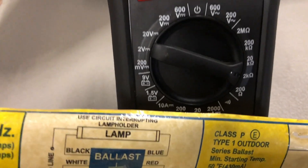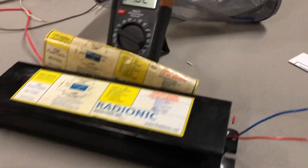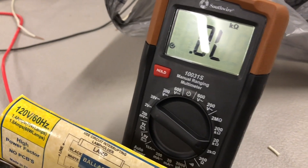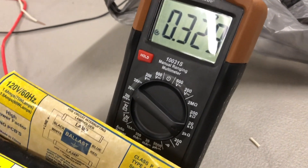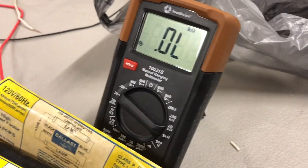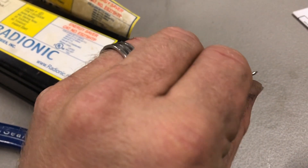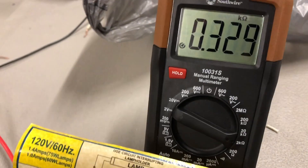The black lead is never tested in this. Here's where I'm at on my multimeter. I'm going to test the red lead — the meter never changes. But if I hit my blue lead, it changes. It should always be an open — it should always look like this with no reading. Here's our red — no change. And here is our blue, and it's making a reading. It shouldn't read. So this ballast is bad.